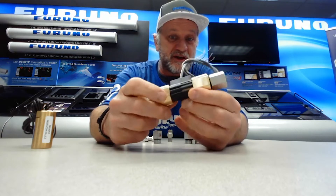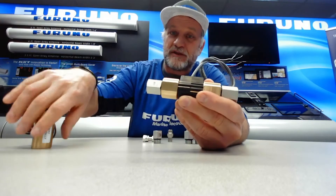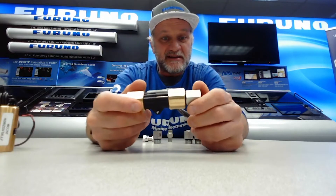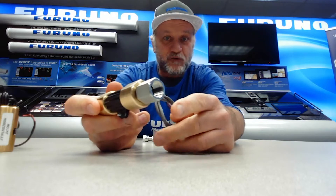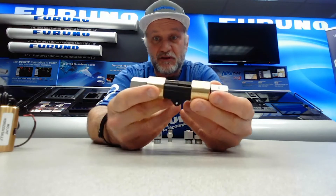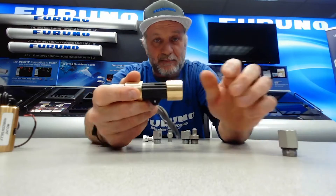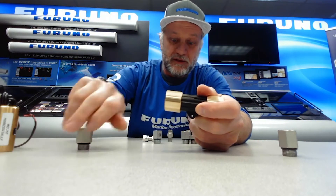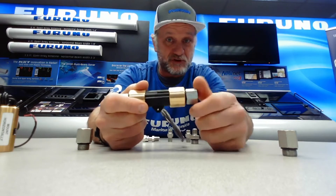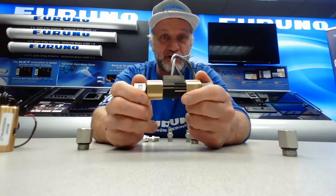We designed SafeHelm 2 to work with a lot of different boat sizes. It doesn't just come with smaller quarter-inch ports like our competitor's product. When we ship it to you, we provide adapters designed to attach right to it for 3/8 plumbing. If you have a bigger boat with 3/8 plumbing on the helm, you can install it with the included 3/8 NPT adapter fittings. We also include smaller quarter-inch adapter fittings — install them and now you have quarter-inch female ports, just like the competitor.